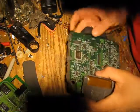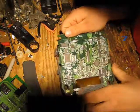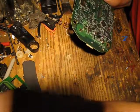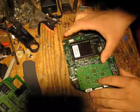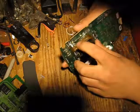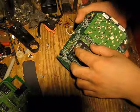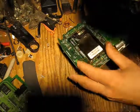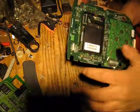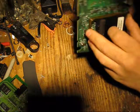This is just the back side of this board. Pull this out — smart card reader, I'll save that. This is cool. This is the actual encryption module. And what this little thing around it is, this is actually part of the security defenses of it. It's connected with that little ribbon cable down in there. So if someone tried to get into this thing without tripping those little security switches, and then tried to poke a hole through this, it would be detected.